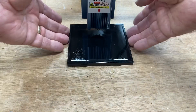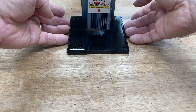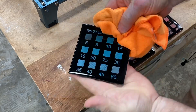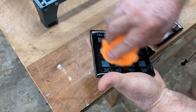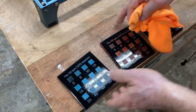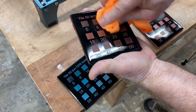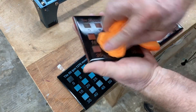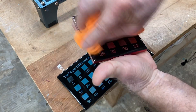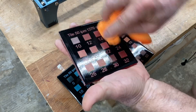Let's go ahead and put this down here. I'm going to line it up on those two marks that I had right there, and then we're going to go ahead and hit start and get this one going. Okay, I've got all three completed. The first step is to take a microfiber cloth and be able to wipe everything down — you want it nice and clean, and that will help remove any of the paint dust that may have been on the tile. Now this is the orange, red, and the black. Wiping it off and you can see those different colors. And the third one, of course, is the red one. Now this is the one that I had made a mistake on — look at that first square at the 10%. It actually is the 50 inches per minute, 10% power, but the difference is it went with four passes. My mistake.